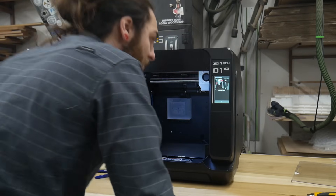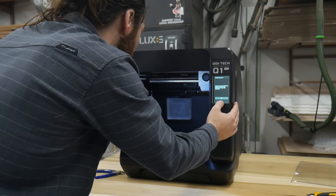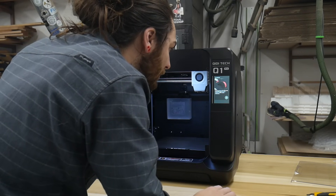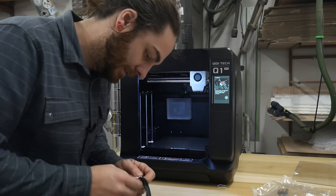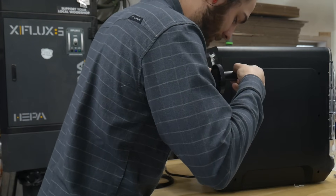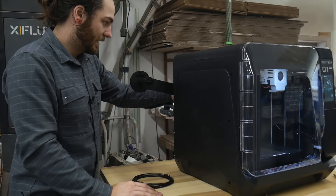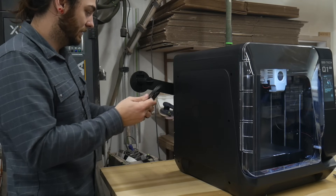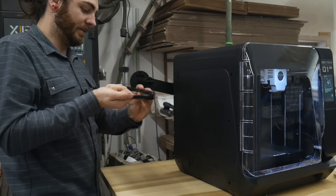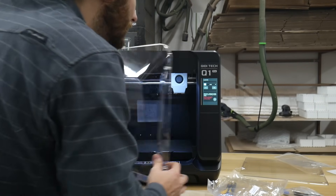Remove all ties — almost positive I removed them all. Remove the four screws — done. Keep pushing the filament into the filament runout sensor until extruded. PLA Rapido Black. It goes off the side like that, I think. I'll just run a filament dryer off the side anyway — it's nice it's not on the back. They basically gave me a half roll.